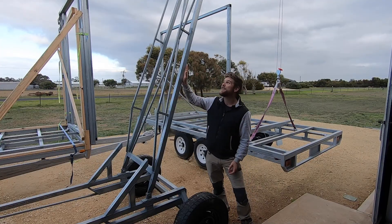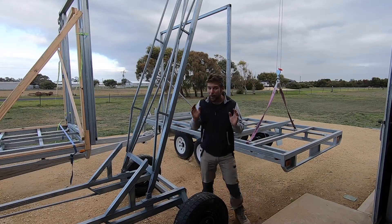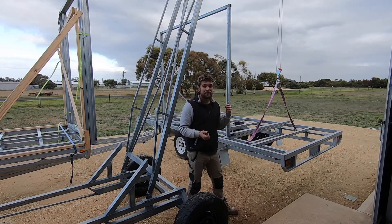There was almost no deflection in the boom, and some flex in the frame — it moved a little bit, but I wouldn't consistently lift 300 kilos safely. For wall frames and roof structures though, this thing will have no worries. Watching the video back it looks like the boom moves quite a bit and you're probably thinking this dude is going to kill himself. You're probably not wrong on the first part, but the movement you see was actually the vehicle lifting up on its suspension as it took the load. Once it came under load there really wasn't that much flex in the frame — it wasn't quite as bad as it looked.